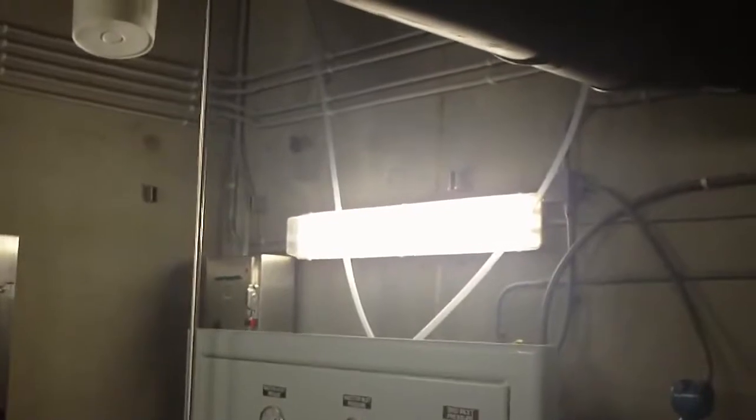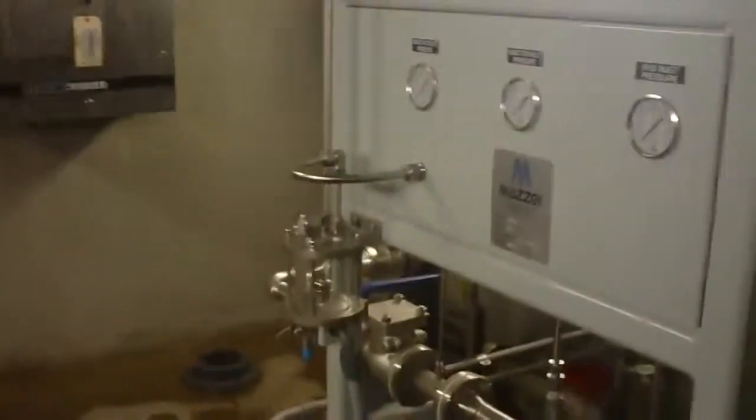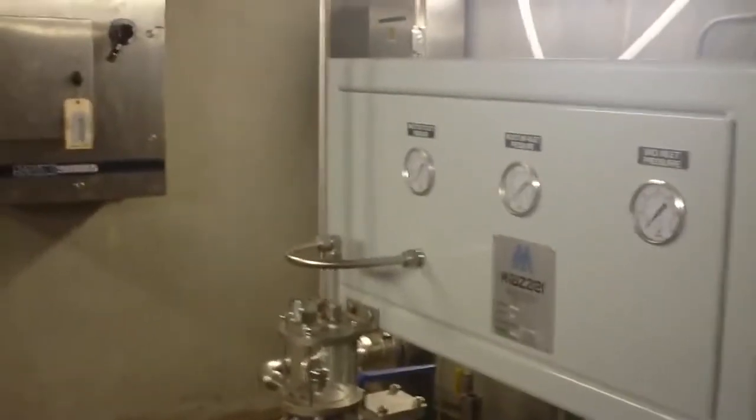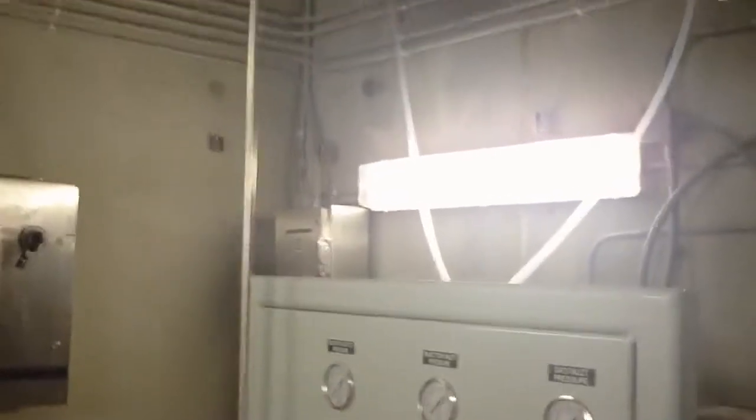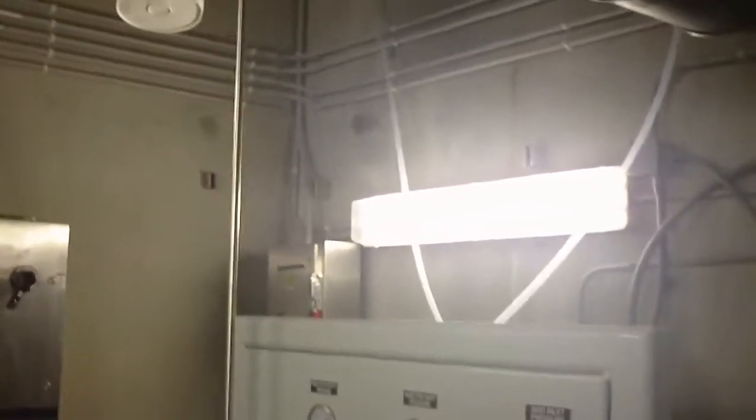Disinfection at the plant should require very little ozone as the water has gone through microfiltration and RO, and there's very little ozone demand left at the end of the plant. But once again, you'll see the little backflow preventer built by Pinnacle, once again to protect the ozone generator from being affected by water should it back up through the unit.